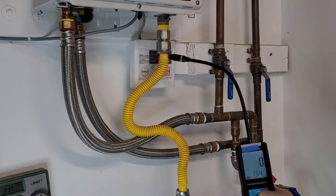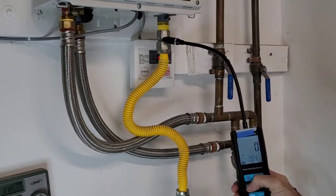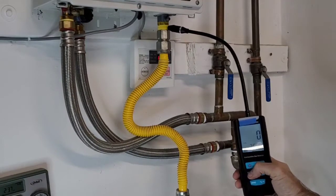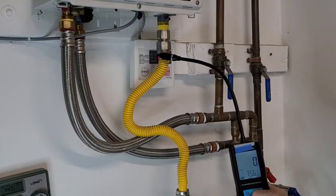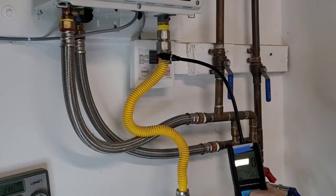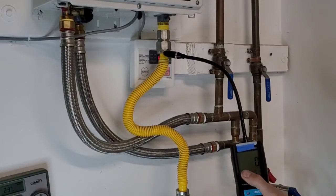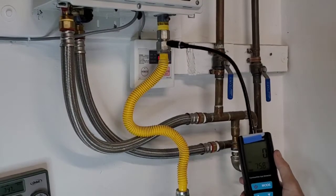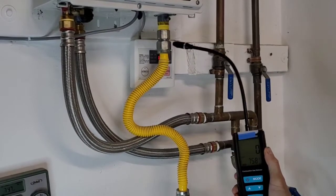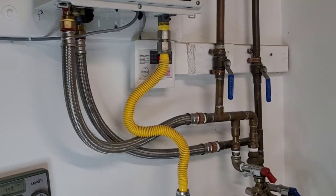We don't see any sign of a response. We'll hold it there for a while. I know there's a leak — we already tested it — and there is no response whatsoever. This device may work well for percent LEL applications, but it's advertised as a gas leak detector and it's not sensitive enough. That's the whole point of this video.